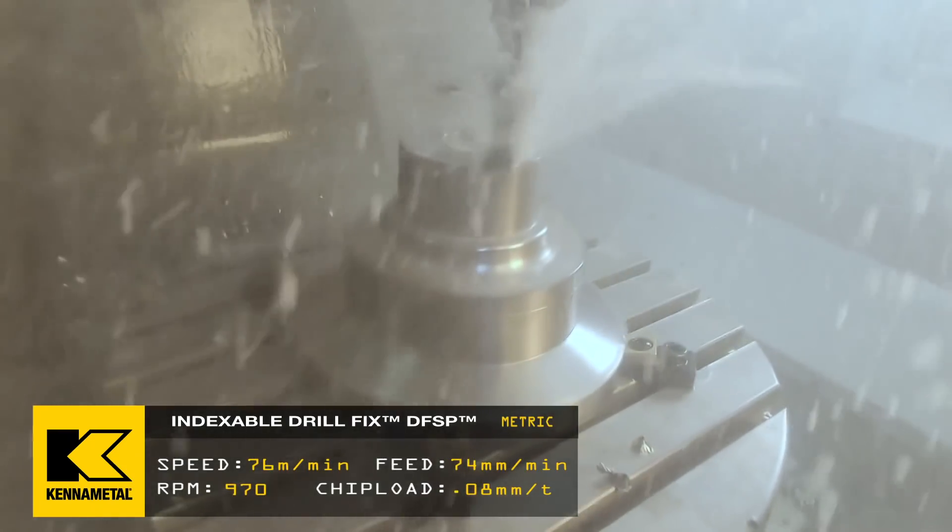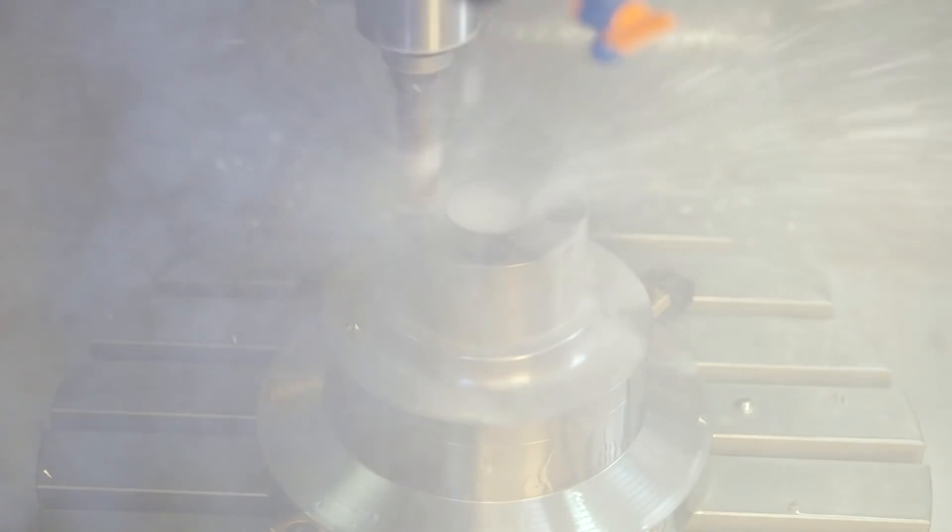This drill is great for titanium — we use it all the time making aerospace parts. It's kind of a standard and commonly known thing that whenever you're drilling harder metals, the drill will run a little bit small relative to its nominal size. So knowing that, we're going to double-check it at the end to make sure we know right where we need to be.